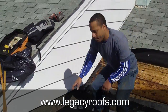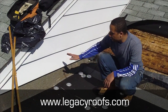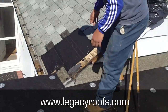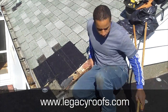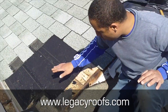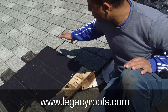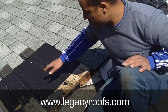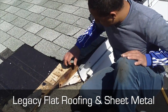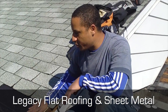We found some issues — we've covered them up with the new board, but there were holes in the membrane where water could penetrate underneath the flashing and cause damage inside. Also, if you look closely, you can see there's no ice and water shield along the bottom. You want a good three or four feet of ice and water shield. It was simply shingles lapped over with open exposed wood on the side.